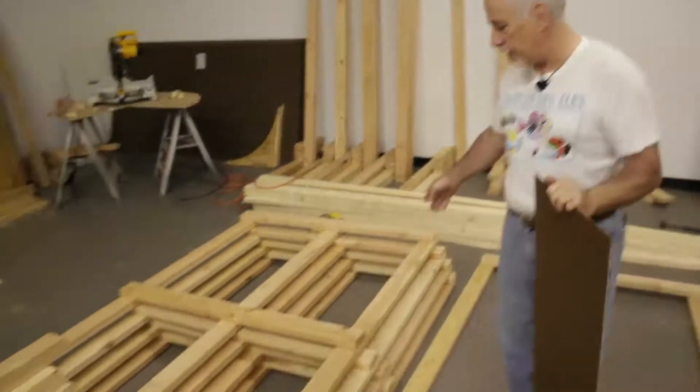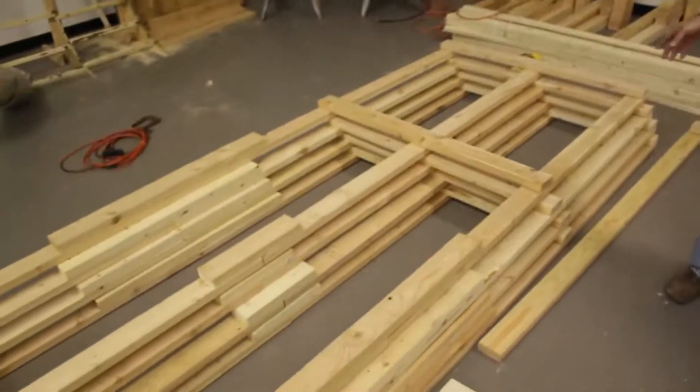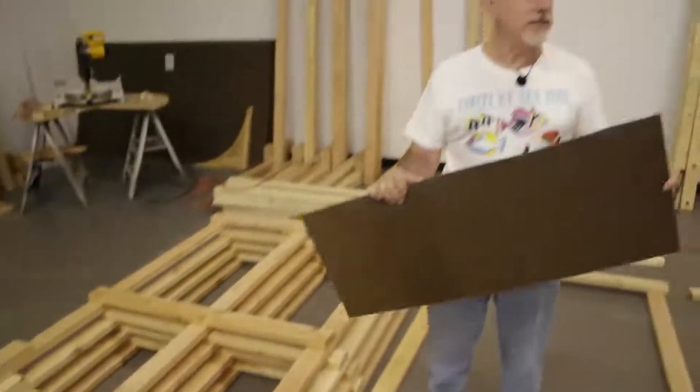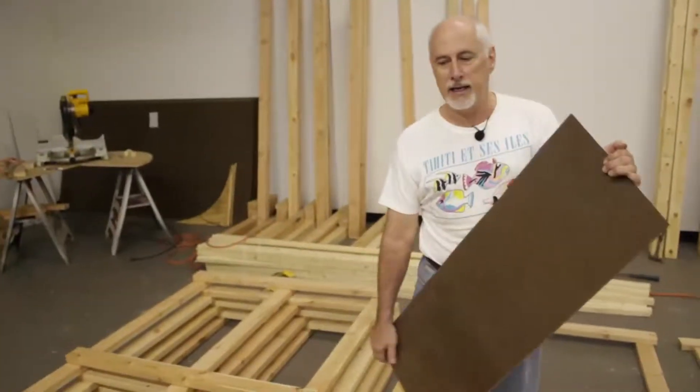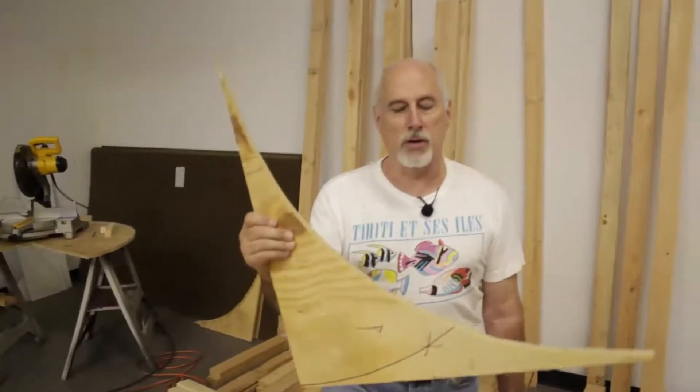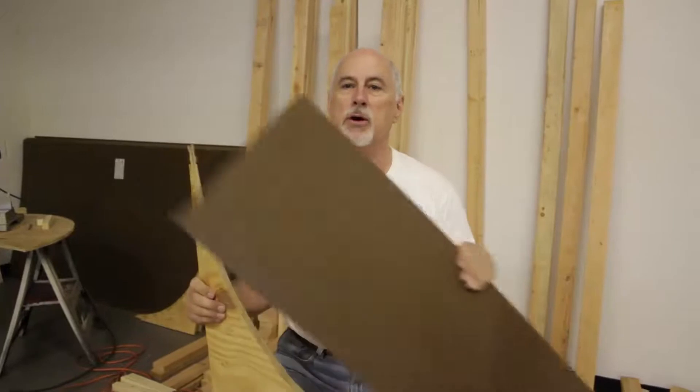What we have done is built up frames — 15 feet high, four feet wide. These sheets come in four by eight sheets of Masonite. We start with one piece coming down the wall. At the bottom of the wall we have curved sections cut out of three-quarter inch plywood, and the Masonite forms to this curve and gets mudded into both the floor and the sheet above it. That's the basic format.